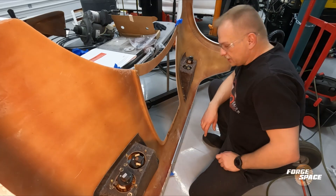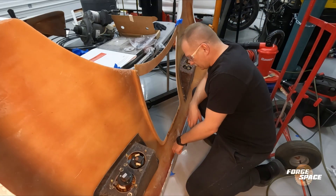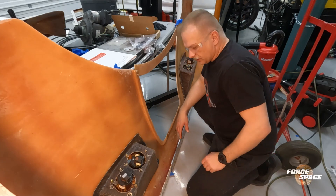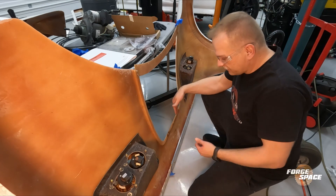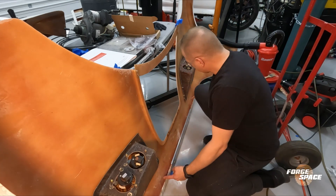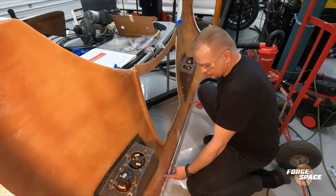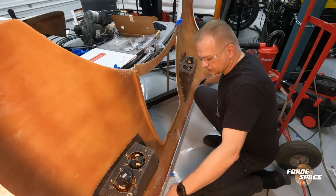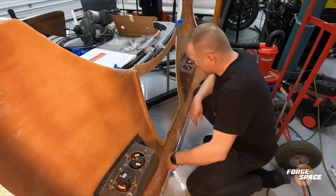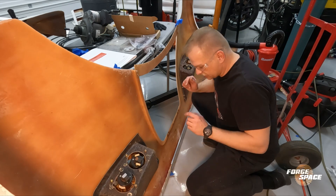While we still have this plate on here, I took this off and brought it over here. We're going to pop this in. I'm just going to mix up some epoxy and keep jamming fiberglass cloth in there until it's completely packed from about here to here — three inches out from where the plate's at — just to keep it nice and stiff across the front. It might even go further than that. We'll see.